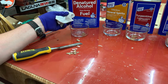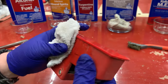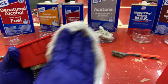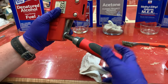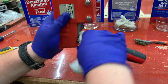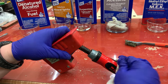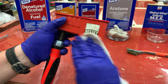Next you'll notice I'm jumping all the way down in solvent strength to denatured alcohol. I've got a clean rag and I'm going to use this to clean the heads — the plastic heads. Acetone is very aggressive and tends to attack plastics. I actually think these Bessey heads are made of a very durable plastic so it's probably not a problem, but just to be safe I like to clean all plastics with alcohol rather than acetone. That's a good rule of thumb for the shop: since acetone dissolves plastics, don't use it to clean plastics. That's why I'm using the denatured alcohol here.